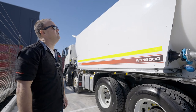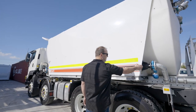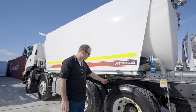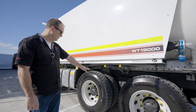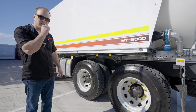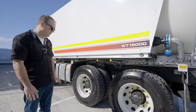Walking around to the passenger side — same thing. Check the boards, make sure these are really secure, make sure all the bolts are in and secured. Checking our guards, looking at our tyres, and having a quick look at our suspension. Does the suspension look good? Look at the springs — are there any cracks? Check the suspension, wheels and tyres all around the truck and make sure everything looks secure.